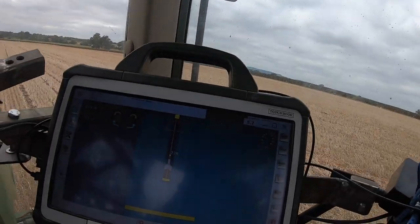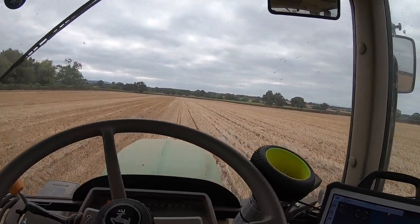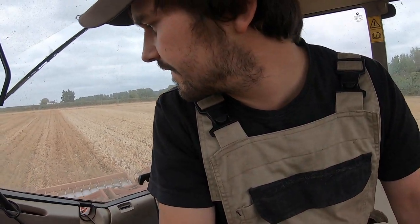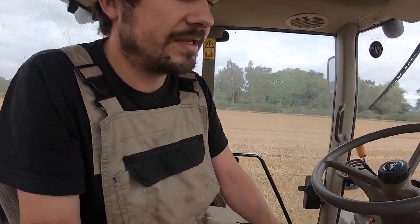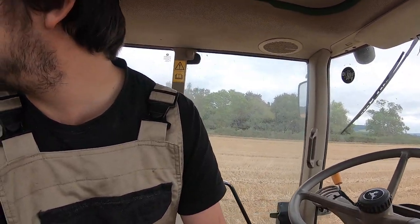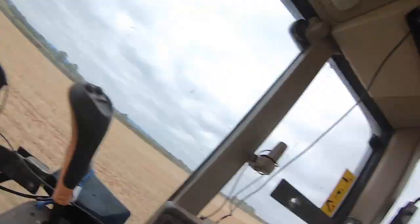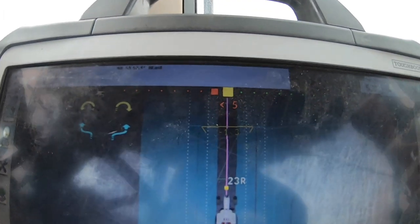Filling in the gaps on the map. You can see there are a few little gaps between passes — that's just where the cultivator's pulling the tractor to the sides. I think it's 10 x 45 kilo wafer weights on the front of here, so it's probably not quite enough — could perhaps do with a bit more just to get the front end down and get the tractor a bit more balanced. I think that's part of the reason why she's perhaps just a little bit light on the front and why it does wander occasionally.